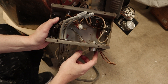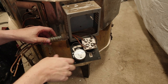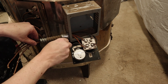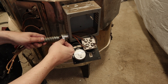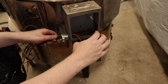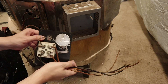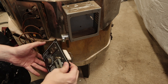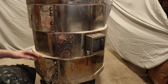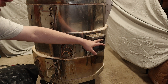The connection to the kiln sitter I will use — this is probably where the wires for the thermocouple will go. I don't think I'll need anything else in the kiln sitter. The only thing left is the kiln sitter itself. I think I will take out this piece of conduit. These wires I have no interest in saving, but I think I can just pull them through. And there's the kiln sitter — Model LT3. Here's the kiln all taken apart. The kiln sitter is removed, though there's still the lever — I'll need to pull that out and replace it.